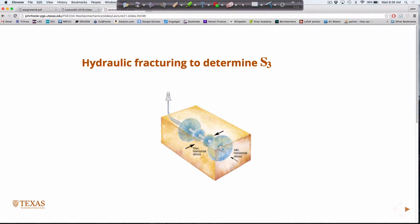We're going to talk about hydraulic fracturing from a stimulation standpoint in quite some detail later, in a few weeks. Keep in mind that this picture represents the classic notion of long, bi-wing, straight planar fractures, which tend to only occur in conventional formations. In shales, where you have lots of natural fractures and other things in the rock, you get a lot more complexity than this kind of straight bi-wing planar fracture — but that's to be discussed later.